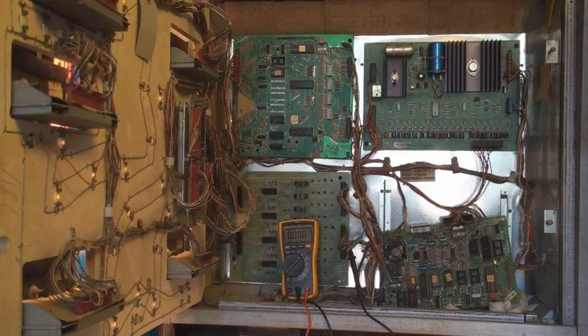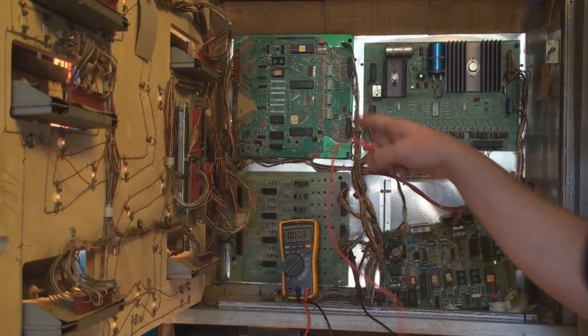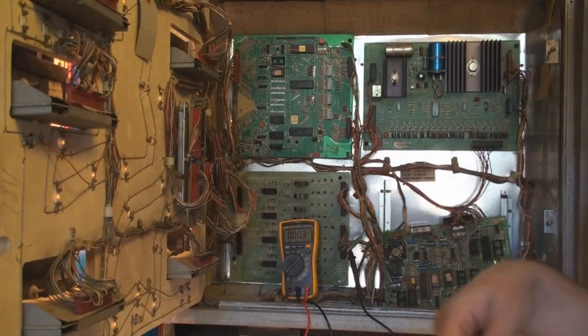And we need to figure out what that goes to. Okay, because that does seem a little bit high. It's almost like, once again, we might be dealing with something that just simply doesn't have that voltage drop because there's an open wire somewhere. There's an open connection, and we're not getting that voltage drop of like 3 volts or 2 volts or whatever. Okay, but that's the only thing that's really sticking out right now.